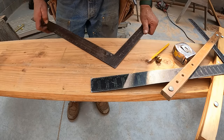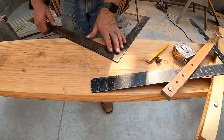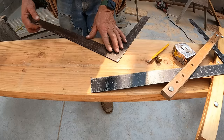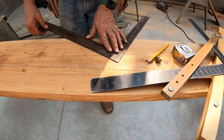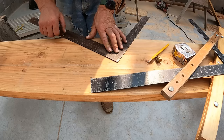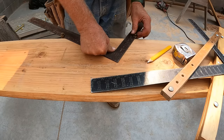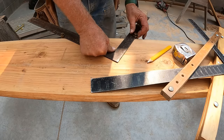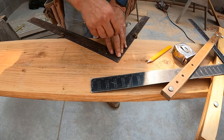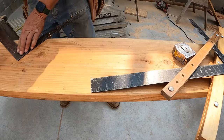And then the best bet is to put the square on the work. Make sure you're right where it needs to be. And then I take the stair gauge set and I just slip it on the square, run it up till it contacts the board, and tighten it down. That's very quick. And in a lot of cases, it's as good as it needs to be. I mean, you can make a repetitive mark with that, on and on, right down the board.